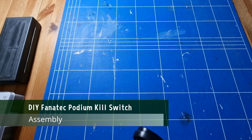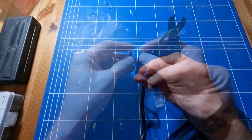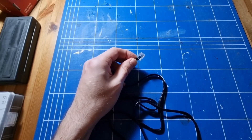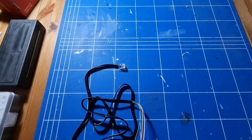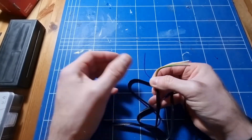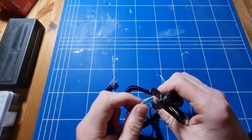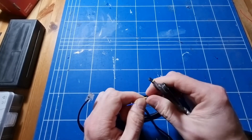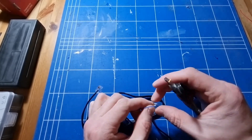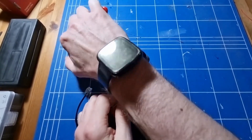The first thing I had to do with this project was to cut the second plug off of the wire I'd purchased — this is the RJ12 cable — then strip back that for the component wires, and strip those wires to be able to solder them. These are very small and fiddly on the cable that I purchased, but spending a couple of pounds more might give you a better overall cable. I cheaped out a little bit here.